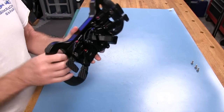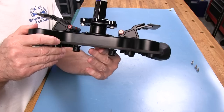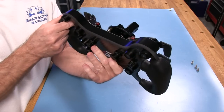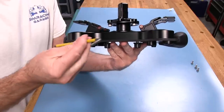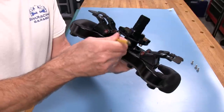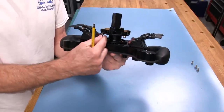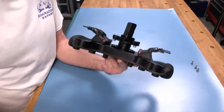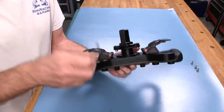Now, another thing here is it's not only just tight for your fingers, but you see the heads of those bolts? Even if I was using a button head, which I don't like using, I like using socket head cap bolts. And so the problem is, if I take a 4mm wrench, which these are, that's the size of them, you can see we're going to have an issue here. It's not going to fit in there. And yeah, so what are you going to do? Now, even my little special ratchet that I have, a kit that has little teeny bits in it, even it's too tall to get in here. So yeah, this is pretty tight. So I had to pull out my specialty custom wrenches like these. And all this is a regular wrench.